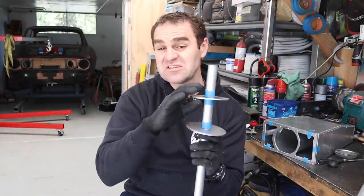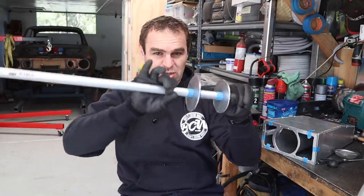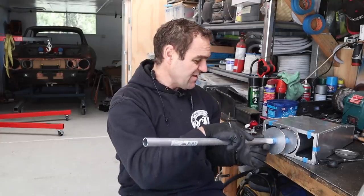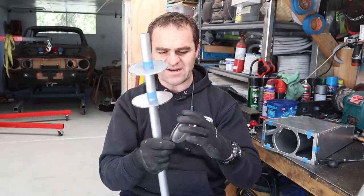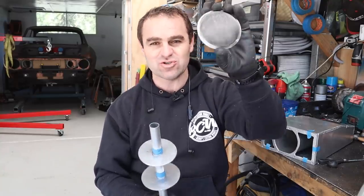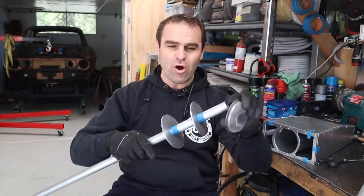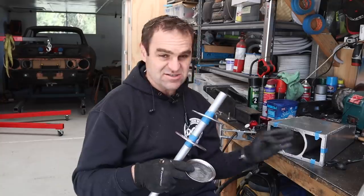My discs are going to be my baffles in the central cylinder of this dry sump tank. I need to drill some holes in them. My plan was to have an aluminium tube going through the center of my cylinder — my cone shape, because it's tapered. At the bottom of the two baffles I was going to have a filter. I managed to go through the kitchen cupboards and found a little strainer that is actually 100mm diameter. I was going to cut a hole in the middle and poke it sort of inside out, with a hose clamp around here to hold it to the tube, plus the taper was going to hold it into the cone shape.